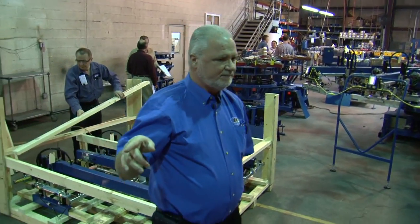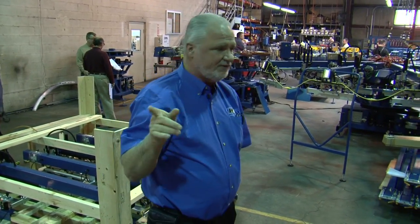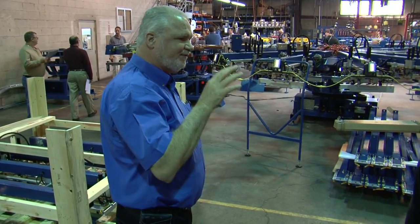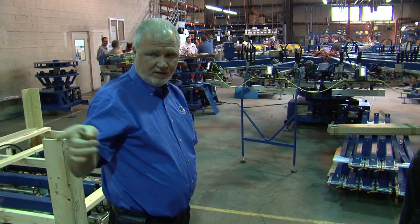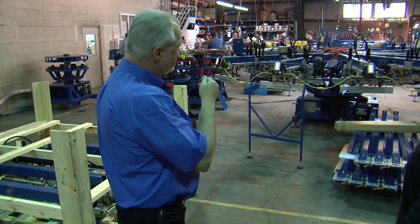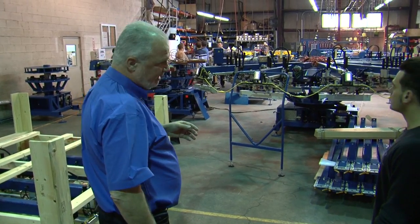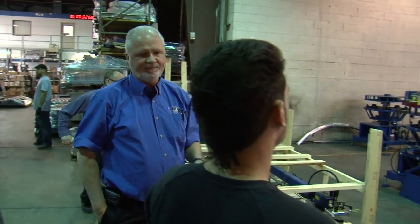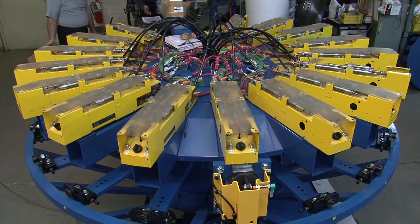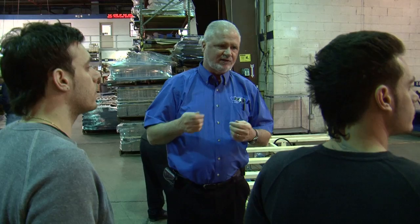After the heads are assembled, they no longer really have to go to see the machine. The only time we will put the heads on a machine like you see here is on the first 10 of a series, to make sure that we have everything dialed in exactly, because it's all being QC tested over there. Once you go past the first 10, we no longer put the heads on — we put on what's called a dummy head. That dummy head is a simulator that will do exactly what the real head does for the indexer, allowing us to QC test the indexer as if it had the heads on it.